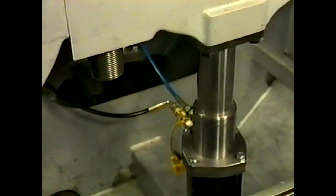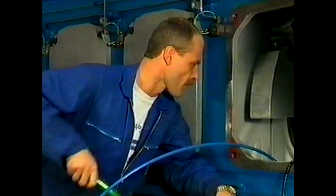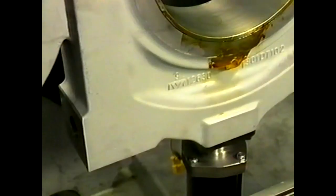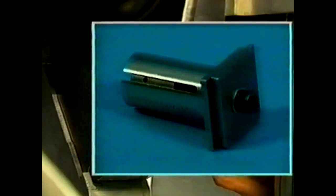The return valve on the pump can be opened, after which the bearing cap can be forced down in a controlled manner. When the telescopic jack has reached its second stage, the cap will be lowered by its own weight. When the cap is in its bottommost position, the lower bearing shell can be taken out manually. Disassemble the upper bearing shell using a turning plate — this plate is placed in the lube oil duct of the crankshaft and secured with an Allen key. Gently turn the crankshaft so that the upper bearing shell is pushed out of the crankshaft bore.